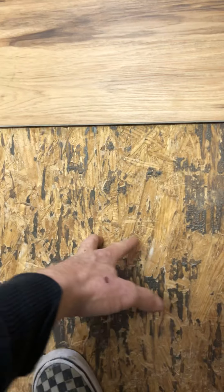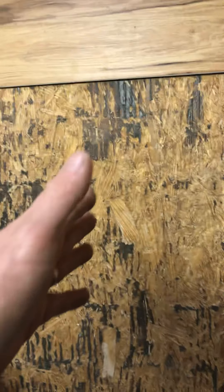The deck is glued to these trusses, so the unsuspecting person who thinks they can just take this deck out — you can't. This deck is not only nailed into the fabricated trusses — not studs or joists as we know them, but wood I-beam trusses — it's also glued down. That would cause major concerns during a remodel because you'd tear the cap off your floor trusses. Don't try to pull your floors out in that case — make a small hole, find out what's underneath, and don't cut through those trusses. They're an integral part of your floor.